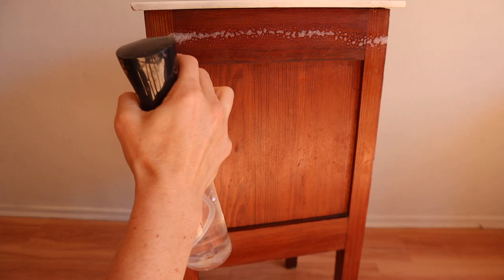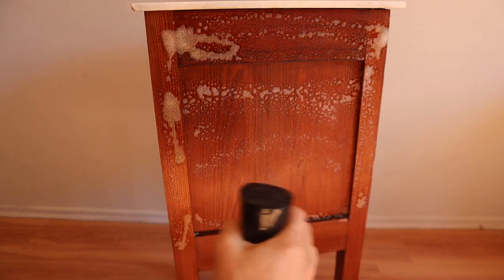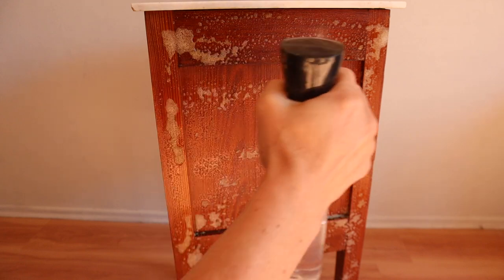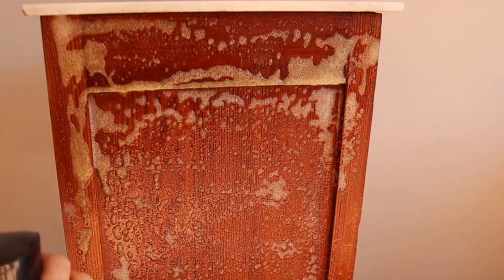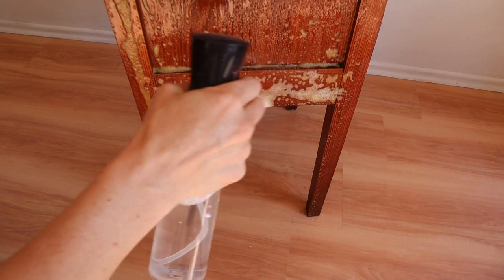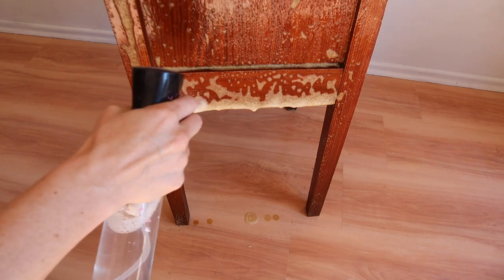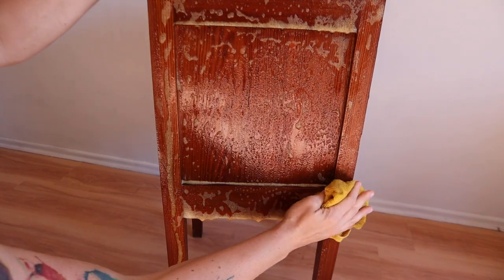Stay here if you want to see that. I wanted to take this opportunity while I was cleaning this piece to show you what to look for and know when you need to use a blocking primer on a piece of furniture. If you can see this cleaner, the bubbles are white and then they start turning a brown color. This could be the tannins in the wood, an old sealer, an old lacquer, smoking, or just dirty. When these bubbles start turning colors, this piece is going to give me problems — I would have problems with bleed-through if I'm using a lighter color. When it starts dripping, it's just dirty from whatever it is, whether it's a failing finish, tannins, or whatever it may be.